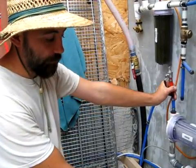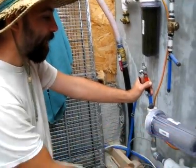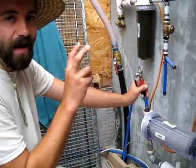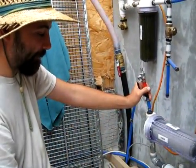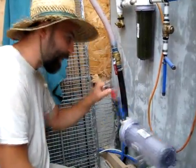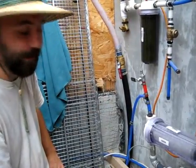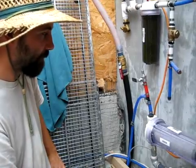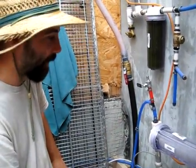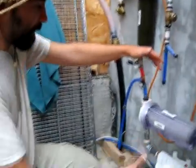After the air goes through the water bath, I have a five-micron charcoal filter in line right above it that I'm using to polish the air. While the compressor head is running, you can actually open this valve and smell the air that's coming through — and it actually smells really fresh, doesn't smell like anything. That tells me we're taking a lot of the potential contaminants out of the compressed air. This is how we clean the air before we send it to the well.